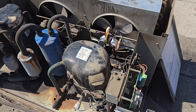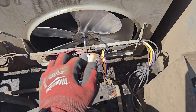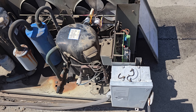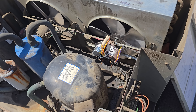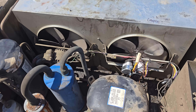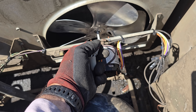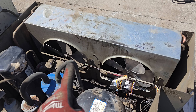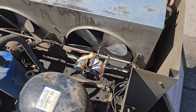We rinsed off the condenser - it really wasn't that bad. We put in a new condenser fan motor, a 9721, wired for 230 volts. We can change the rotation if needed. The wires are secured and this thing is ready to turn on - hope it doesn't blow up. It should be going in the wrong direction, so that's fine - that's why we test it. All we need to do is switch the wires around and flip it, and it'll go in the right direction. There we go - now we're going in the right direction on both motors.